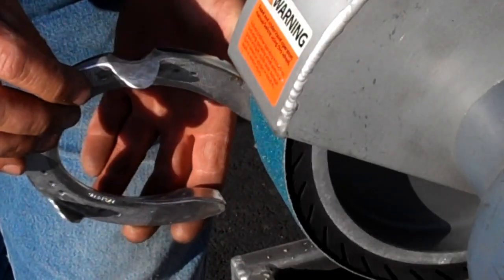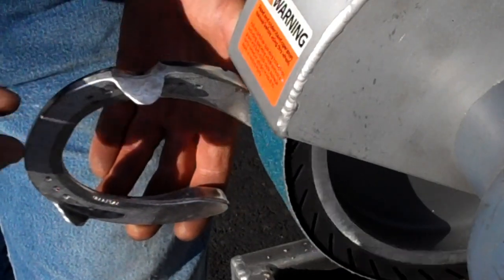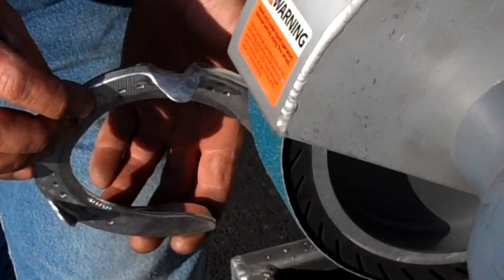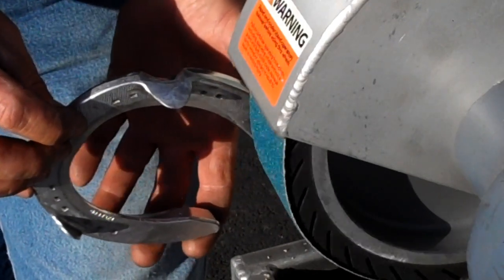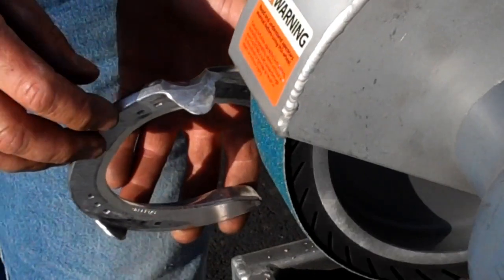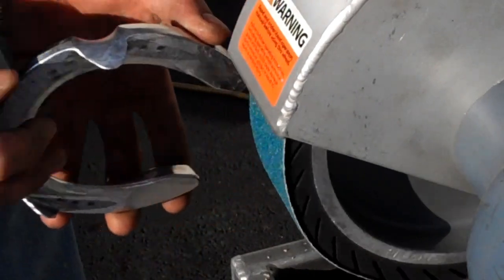When you're having to clip aluminum shoes, a lot of times they get kind of big and drawn out, so you can very easily just clean this up and make it nice and easy to fit very quickly without worrying too much about what it looks like coming off the hammer. So we're just going to clean this up, straighten it up a little bit on the grinder and show you how to do that.